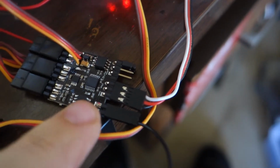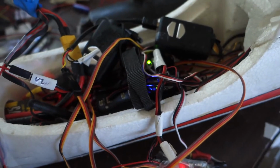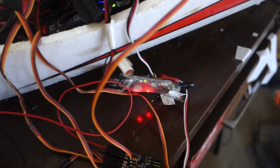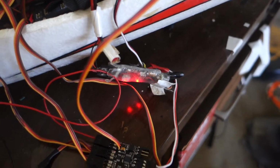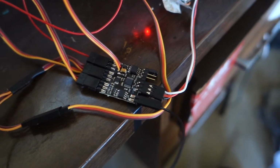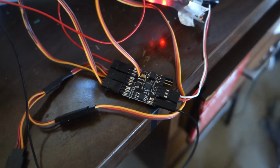That means if you connect the plus port to, let's say, my FPV cameras over there, those cameras have their ground connected to the OSD board, and the OSD board is connected to the real ground, which means just sending 5 volts to them is enough to have the ground be connected, which means it will power on. So unfortunately, the way this board switches makes it impossible to just use its output to switch things that are connected anywhere else, like FPV gear.